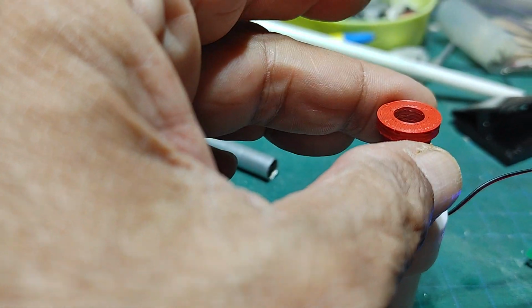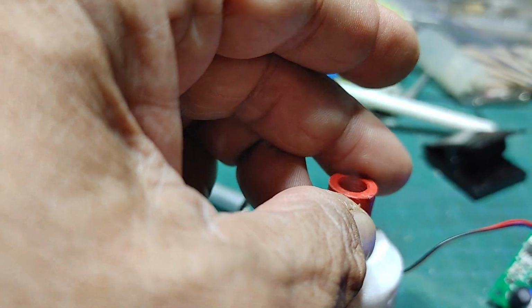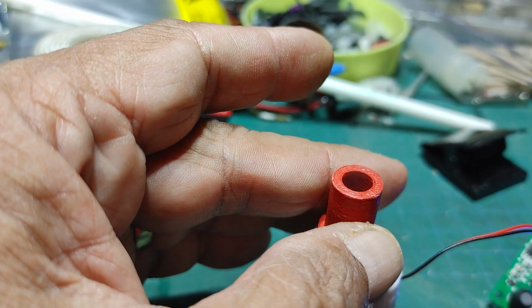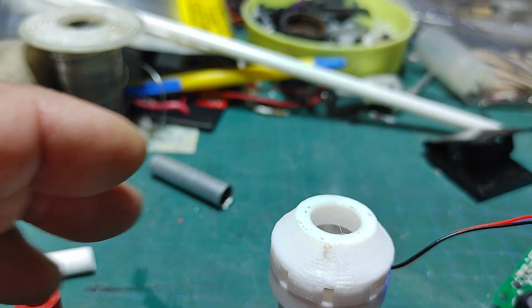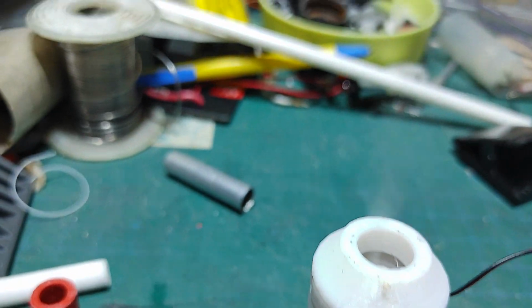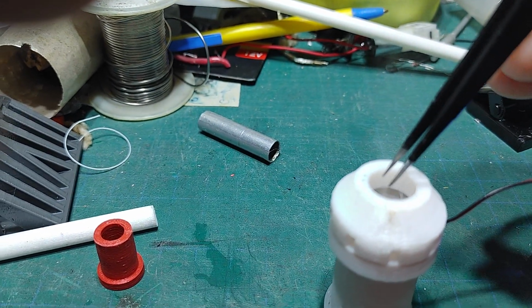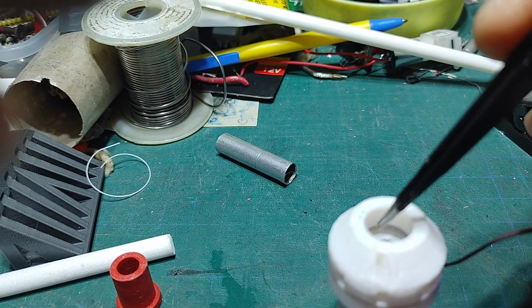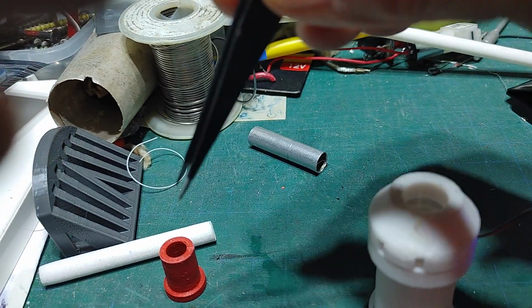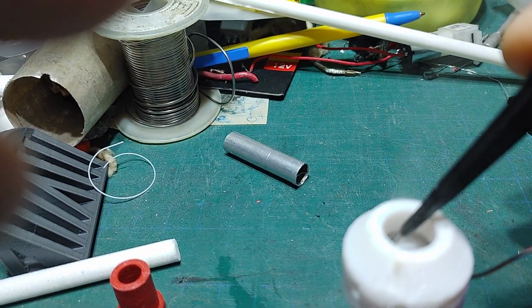So if we put the smoke stack, you can see how the smoke is more consistent. But it also has to do with how close the piezo element is to the surface of that little sponge or filter. Now notice when I press this a little bit and make it a little more in contact with this filter that's inside there that carries the water,